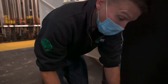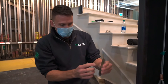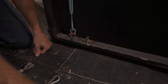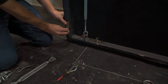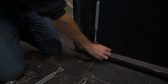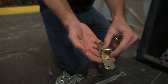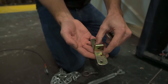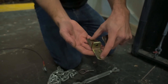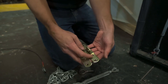Now let's talk about what we do use — these are scenery hanging plates. They can go nicely on the bottom, or we have others that lift from the side. If you look closely at these, there are two holes with a taper on them — those are for your screws to set them — and two holes that are not tapered, which are for your through bolts. So you set them first and then attach them with through bolts. That configuration is consistent throughout all of these plates.